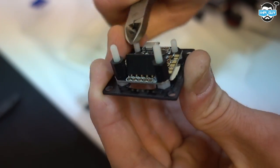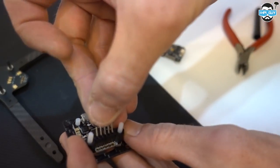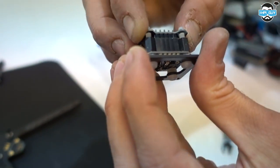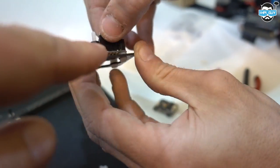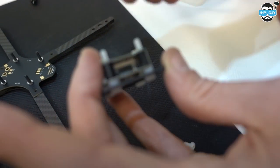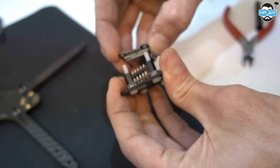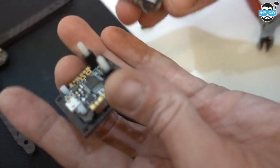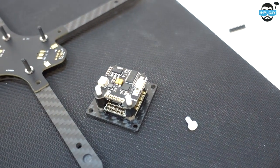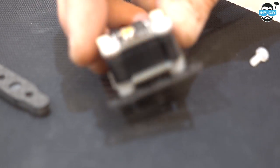In case something gets bent or broken. These will be soldered to our transmitter and the whole thing is going to sit together - that's why we need that extra space. We could put another bolt on, or we can obviously just put those pins in and solder them as one block. So if you don't want to have the plugs, you can just solder them through. Or you can wire it between there and then fold it back over if you think you need that access. But once you've put one of these together, you don't really need to get in there again. That is a crazy small, neat little stack.